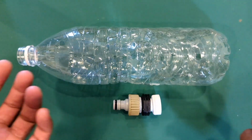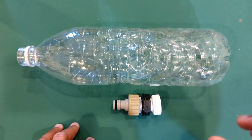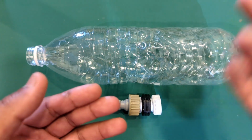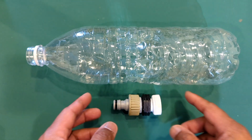So to actually remove the trough, it's a little bit tricky to describe here, so just check out some videos for your specific aircon. But once you remove the trough, you're left with a flexible tube which connects to the pipe outside, and there's a lot of gel or slime accumulation in the tube.